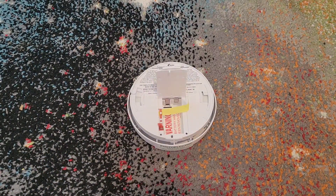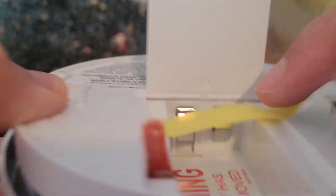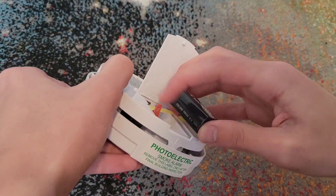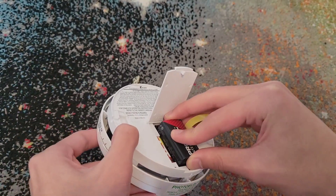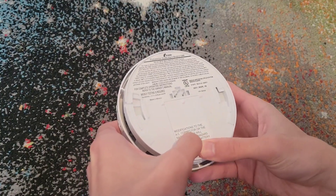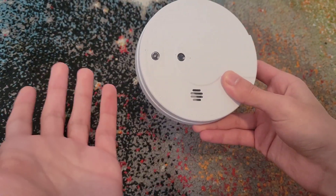Once all the power has been drained, you want to put the battery in. Follow the diagram right here — you can see it's kind of engraved into the plastic. On the left side it's positive. Make sure this battery flag is down — you want to slide the battery in like this and then force it down. Then close the battery door so you can actually attach it to your harness and put it back up on the ceiling depending on what it is.